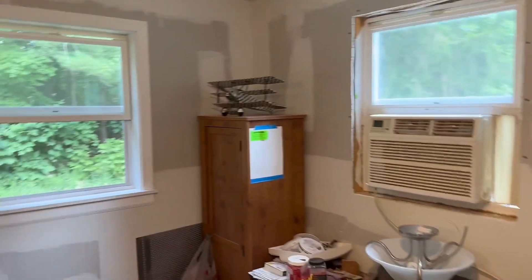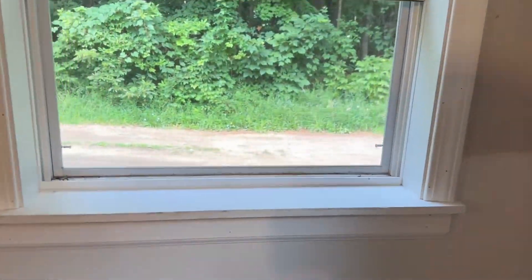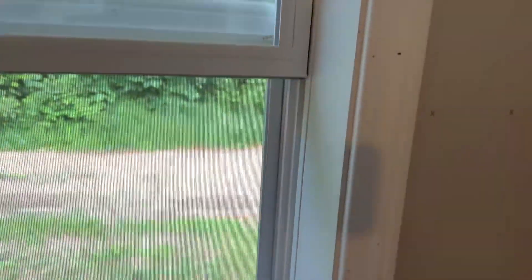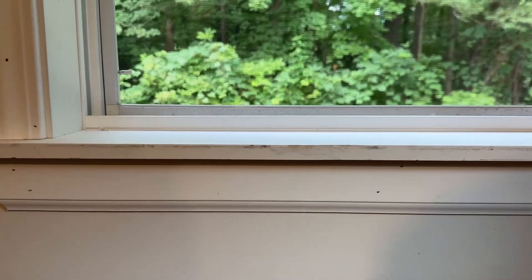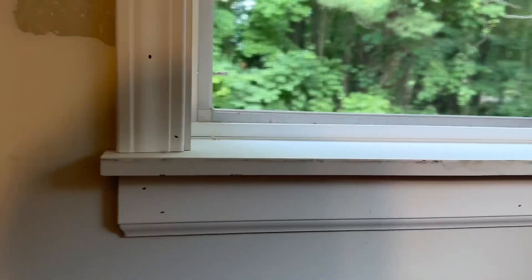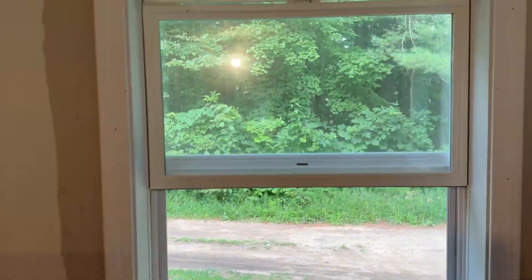What we did is we like to do everything — make it a kit first and then put it up. All these windows are identical; there's 11 of them. We like to make a manufacturing process, which works really well. Here's our test window — this is what all the windows are gonna look like when they're finished casing. It's got the four and a half inch sill and the nice apron underneath it, which is basically a piece of baseboard two and a half inches wide that we put upside down. See how we return the ends into themselves — that's really nice.